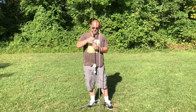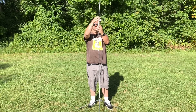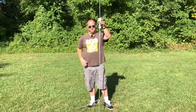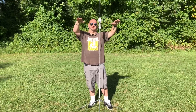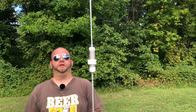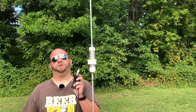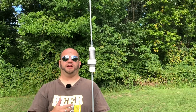I will put the whip on first because I'm not that tall, and extend it before I put the coil on — otherwise I won't be able to do it. If you're Andre the Giant you probably can, but I'm not. The idea behind this is by center loading the coil, your takeoff angle goes down, so we can work the DX stations better. As far as tuning these, they're not difficult, but I strongly recommend bringing an antenna analyzer with you.